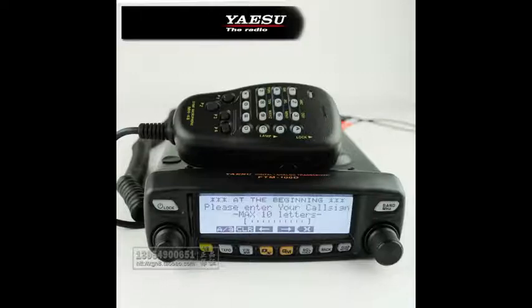So let's do a little bit of, right now the radio is on, and I'm going to turn it off. Okay, it should be off now, and I'll just check by pressing the power button momentarily. And we hear nothing, so it's not powered up. Now, let's go into PDN mode first. All that requires is holding down the DX button, the mode button, which is the fourth one over, and turning the power on. Okay, we are now in PDN mode.